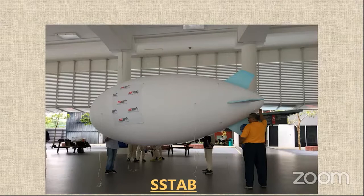And sir, while fabricating an airship or a blimp, we are attaching these fins for the controlling of the airship. So sir, how are they going to be in the position as they are? I'm not understanding the question. The question is about fins, is it? Yes, sir. It is about fins being completely rigid with the system, because the envelope is a lightweight material, it is a kind of a cloth. So how are the fins at one fixed position, not bending over or anything? Because we are using cables at the front and the back.